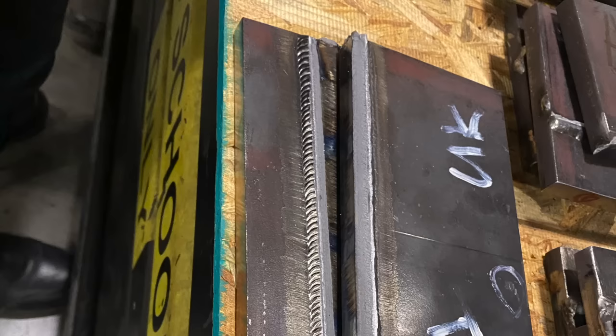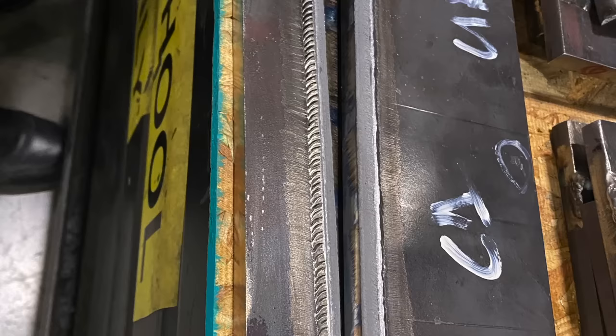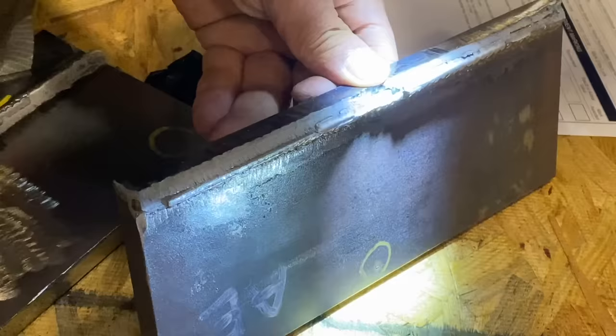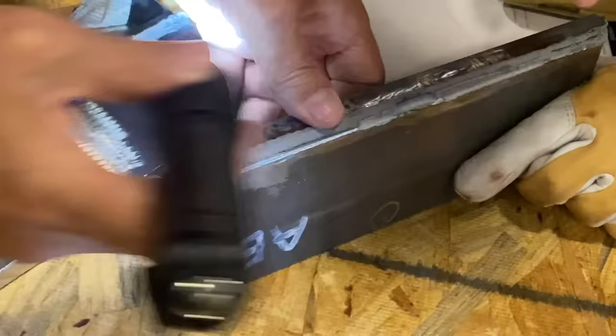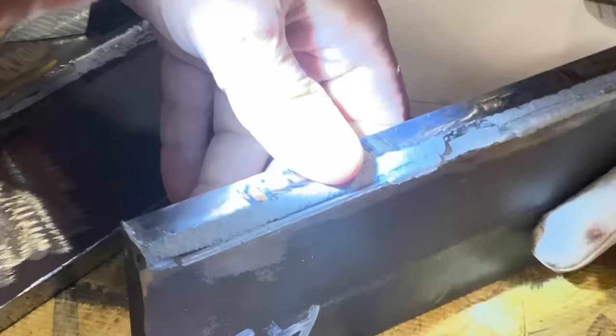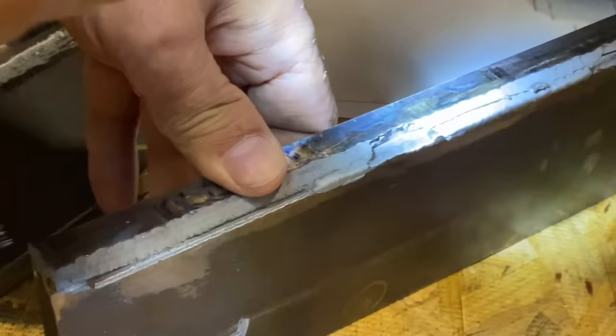This is the 3F hardwire MIG. This is a good one — no problems here. The guy hit the root, no problems in between. And it broke down the edge, you see? The edge just broke down clearly. Root is okay, but the second pass did not keep.